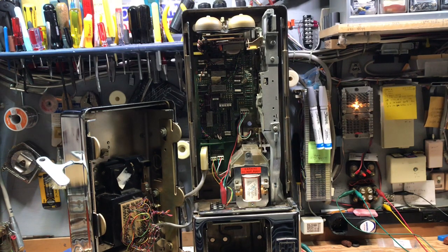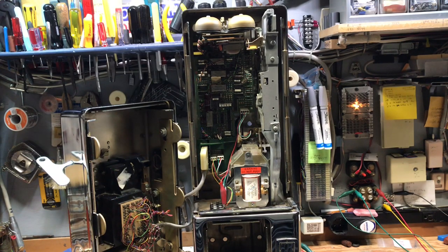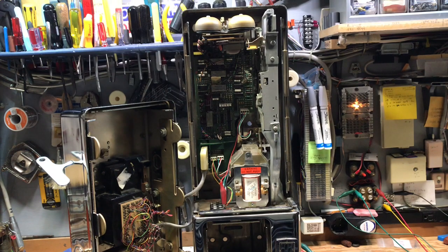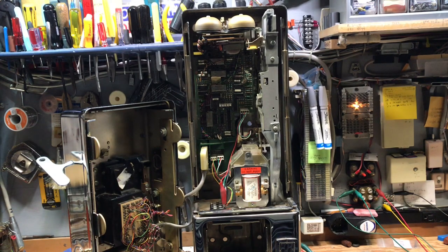It was very flexible, so this was a replacement for the triple-slot phone. You just optioned the board to match what the three-slot phone was set up for and then you had a working phone. I will deposit a coin and then have dial tone at that moment. I'll dial a call, answer it, and you'll see the coin relay operate and drop a coin into the coin box. I'll also dial a number that is not answered so you can see the coin return, and I'll demonstrate what it sounds like if you were to dial the operator.